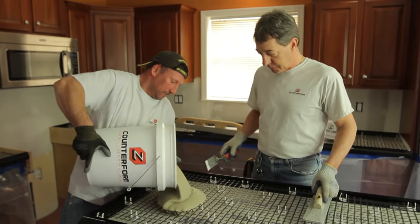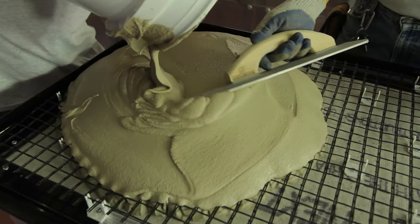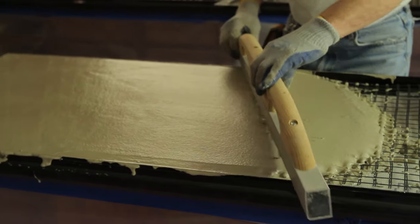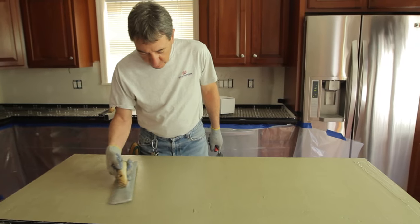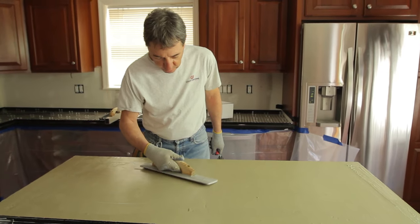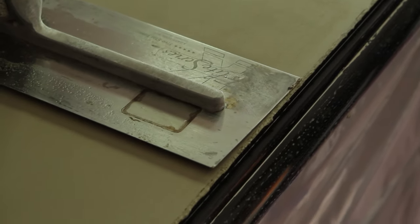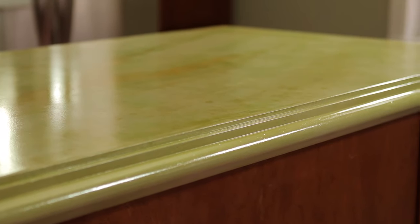Our clips and mesh were specifically designed to be used with our fiber-reinforced LiquiCrete system. LiquiCrete in conjunction with a 60-pound bag of sand mix makes a highly flowable mix which will flow right through this mesh, creating a very strong, crack-resistant top.